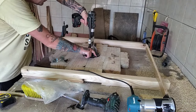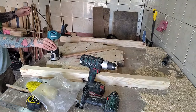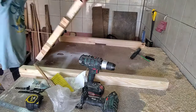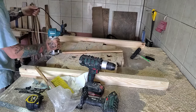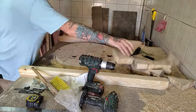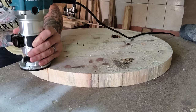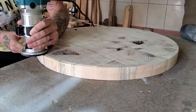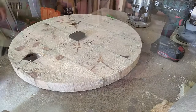We finally come to the most gratifying part, something I've been looking forward to — time to carve out the actual shape of the clock. First up, I sink a hole right in the middle. This marks the heart of our clock face, right where the hands will eventually sweep from. Using my circle-cutting jig, I carve out a near-perfect circle for our clock. Next, it's about getting things a little smoother — a quick rough sanding to get rid of the harshest lumps. A round-over along its outer edge softens it up, giving it a friendly face. Just look at that — a born-again piece of scrap wood, reincarnated as the face of a clock.